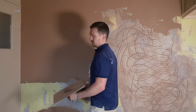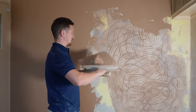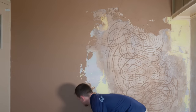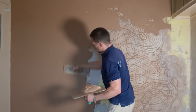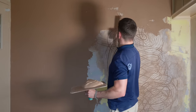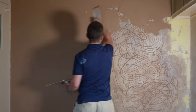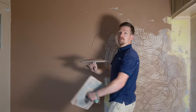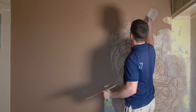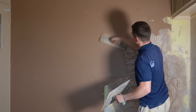We're going to apply two coats of plaster with it. This wall's been PVA'd — it's all been sealed — which is not the issue. The issue is the different backgrounds we're working on, leading from existing into the hard wall. What we might find is this area might end up drying a bit faster than the existing wall. Anyone who's worked with a porous plaster like hard wall knows it dries a lot faster than if you're plastering onto an existing background.